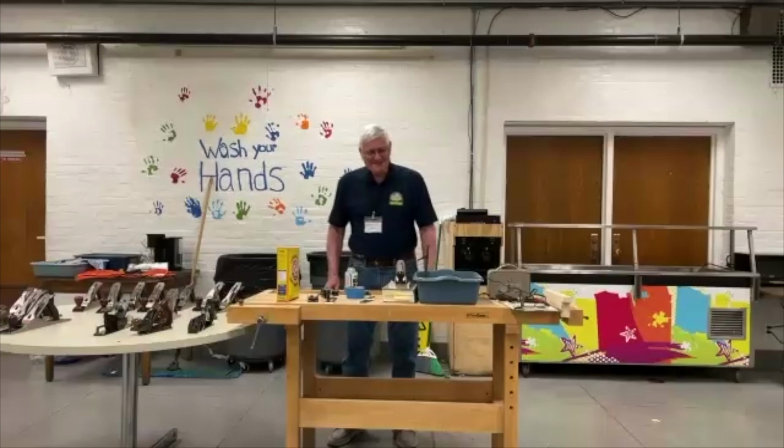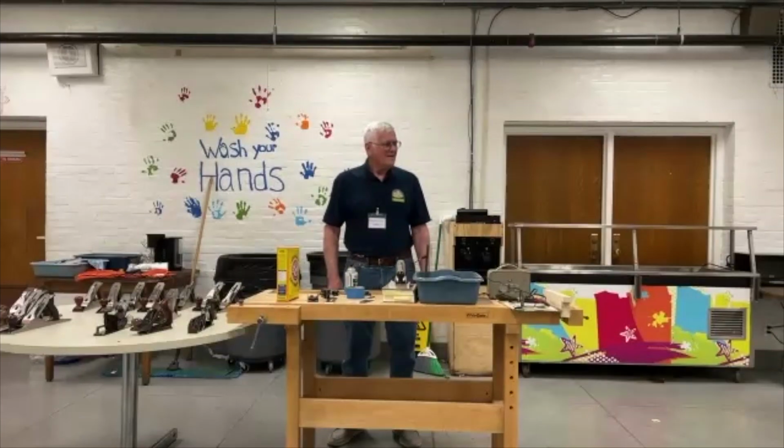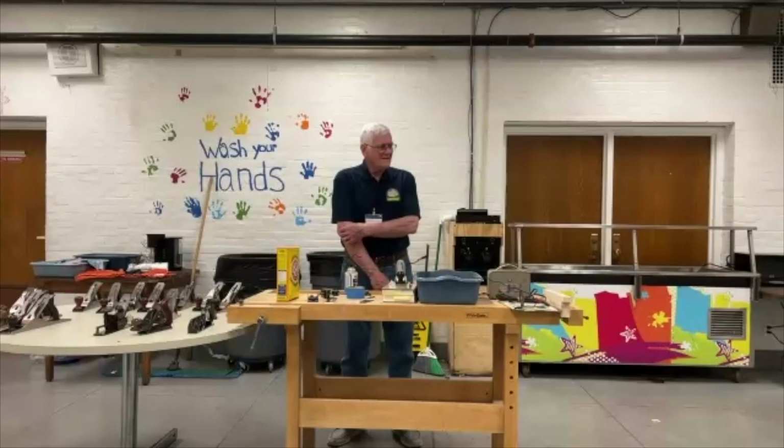For setting up the plane, once you have them adjusted, I keep a 3/16 thick piece of maple on the side of my device. I clamp that 3/16 thick piece of maple, and I use that for my lateral adjustment. I take a pass from the left of the blade and on the right. It's the exact same shaving. I get the lateral adjustment for it. I think it's the fastest way when you do your initial setup.